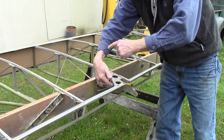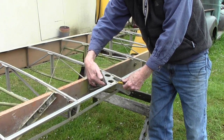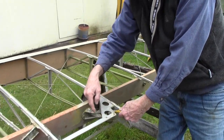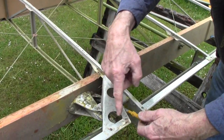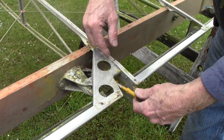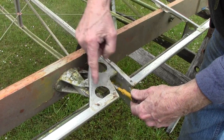So with your interconnect cable and carry-through cable together, you can clamp this and hold it so that the bell crank is absolutely perpendicular to the action. That's about the correct position for the bell crank right there.